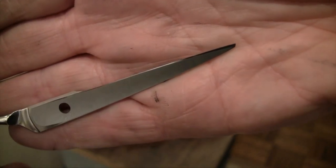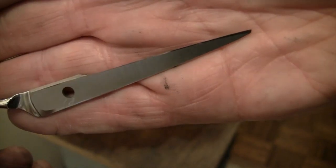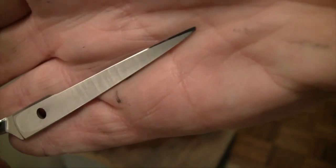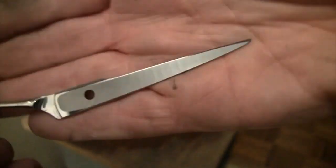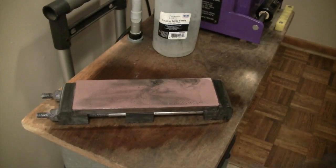We have a ride line around the back, a ride line that's been established underneath the chamfer I created, and now the ride line goes all the way down the edge all the way out to the tip. The tip of the ride line is a little thicker than I like, but that was already there before. All of these blades I'm using here have been used in different presentations over time — they're kind of junk shears just floating around. But you can see we've re-established an entire ride line now all the way down the blade. This is a very important thing to know when you're doing sharpening. There are numerous ways to accomplish this — a number of people are making equipment and showing techniques for re-hollow grinding, and that works well and is probably more factory-pure, but a lot of times that equipment is not readily available when you're out in the field.